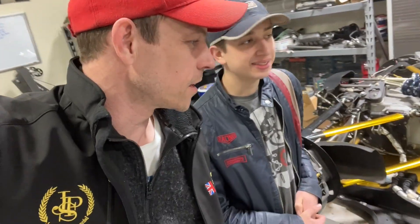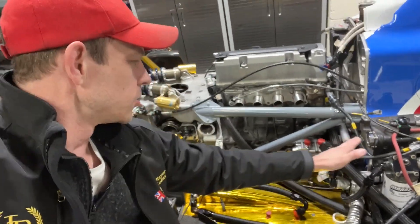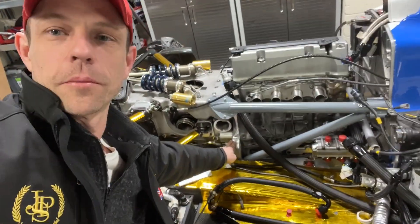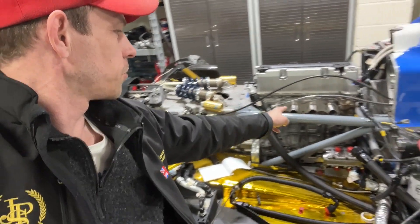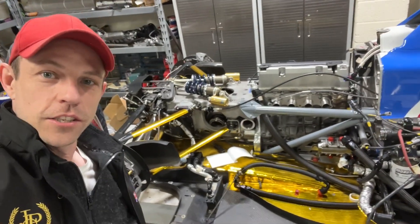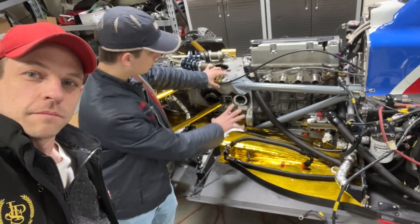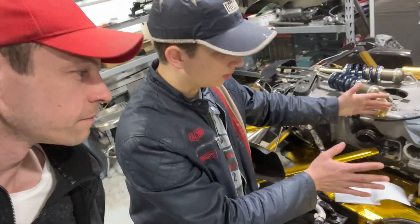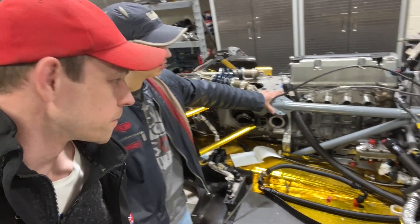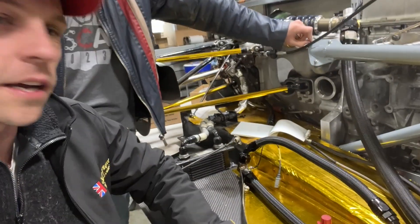It's not fully stressed. I am fully stressed. He mentioned the big billet aluminum oil pan — that's taking the loads and mounting from the monocoque here with the four pins to the transaxle adapter plate, and then this trunnion or A-arm very strongly triangulates in there. The engine is bolted down, and any movement of that oil pan is also going to try and move the block, so the block does add some amount of stiffness to the assembly.